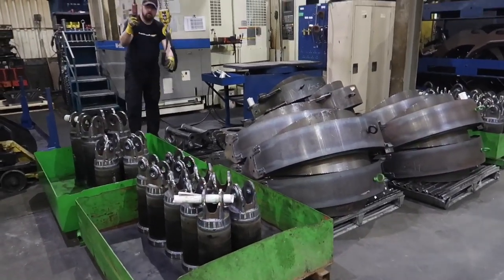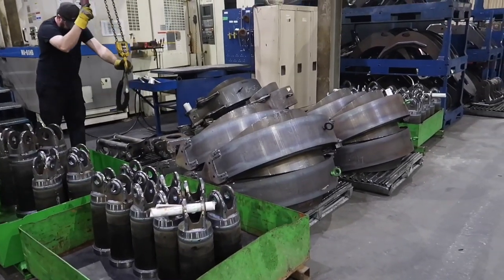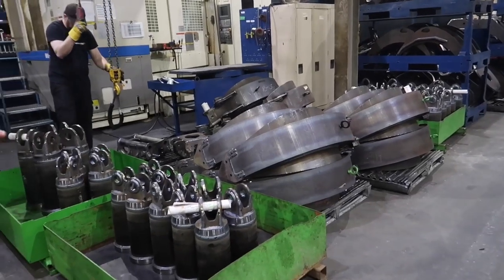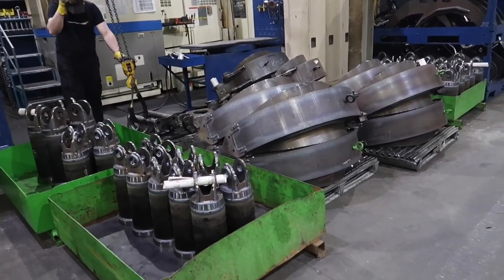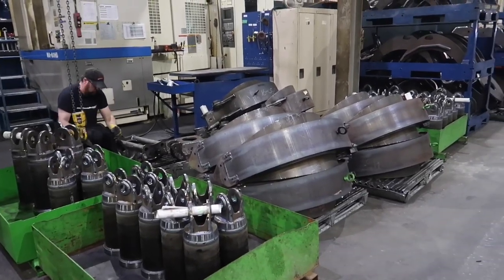So we have a pallet similar to that in Littleton. Cool thing about a pallet changer is it never stops. There's two tables. One that works, one that's in setup, and then they rotate. So it's very fast. It's a continuous process. It never stops or anything. Exactly.